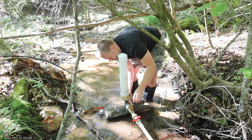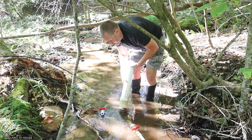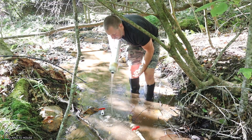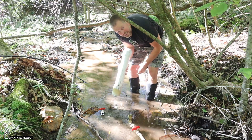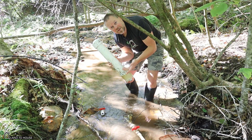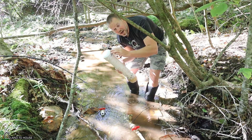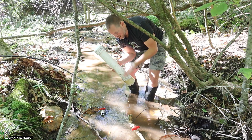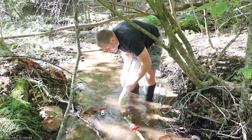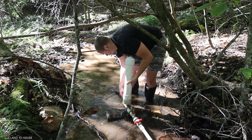After about one to two months of operation it's important to drain the pressure tank because it will get waterlogged over time. Typically in normal operation — for instance in this one-inch pump — there is only about four to six inches of air space; everything else is water, and that's just normal so don't worry about that. I'm going to get the delivery pipe hooked back up.